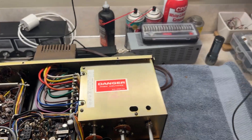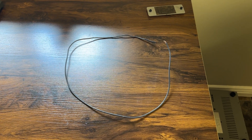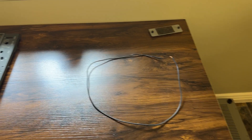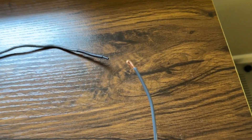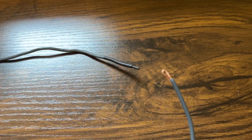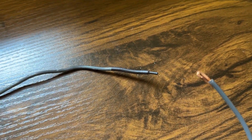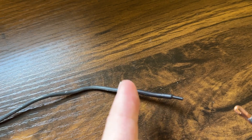So what you're going to need is — here it is, I'll just put it on the table — it's a two-foot piece of insulated wire out of 12-2 Romex electrical wire. I just took one of the pieces out; you can use any wire cord, doesn't matter. It's not critical — two feet, two and a half. Strip one end about an inch off and bend that over and crimp it down. This will fit nicely into the SO239 on the transmitter. On the other end, do not strip it, but put some heat shrink tubing over the end of it, because it's still going to have bare wire where you cut it, and we can't have that with what we're going to do.